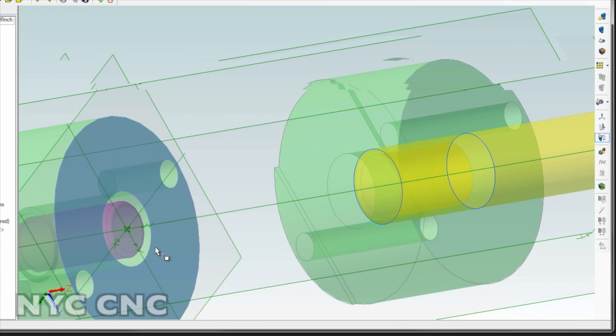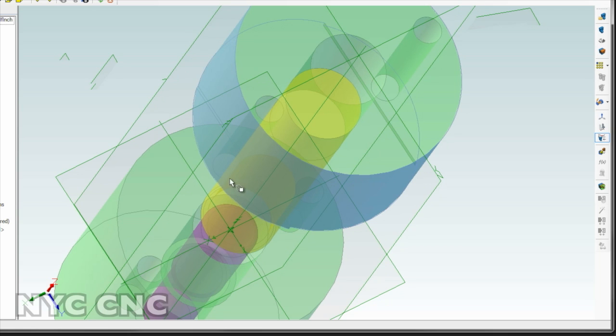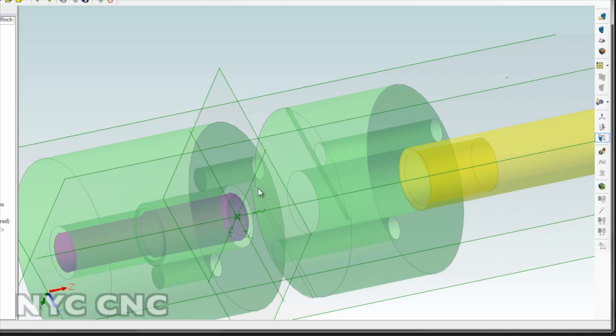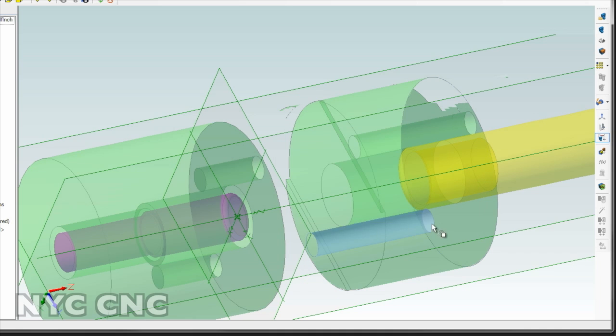This hole will be about .505 or .506 — you need a little bit of clearance for a proper shear. I don't have a problem using a four-jaw to get these two slugs separately lined up, boring the holes separately versus together, which I think is the way I'll go. The question then becomes ensuring that these alignment pins are perfect — they've got to be dead nuts perfect, and that might be a little tricky.